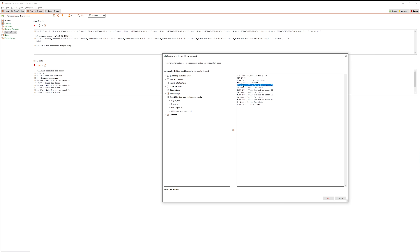Here we have a series of commands that are going to slowly cool down the bed. We're sending M190 with S90 — that's the temperature, 90 degrees Celsius — then it's going to wait for 10 minutes, then we go down to 80, 70, 60, and so on. The dwell commands allow the machine to wait — we dwell for 600, and the way I have it set up this is going to dwell for 10 minutes. At the very end we do M140 with S0, and that's going to turn off the bed. It's pretty much as simple as that — it's just going to slowly cool down. Somewhere around the lower temperatures the part would just kind of slowly start to lift off, and I could grab it off the bed and hit stop. This worked out really well — no warping issues and the part was able to cool down nice and slowly.